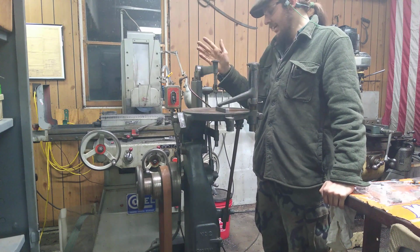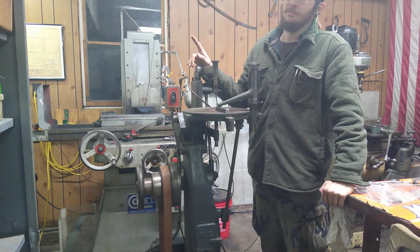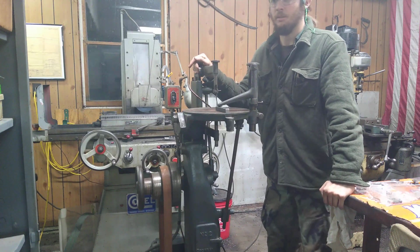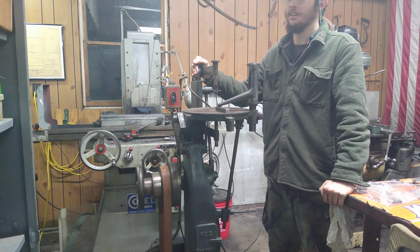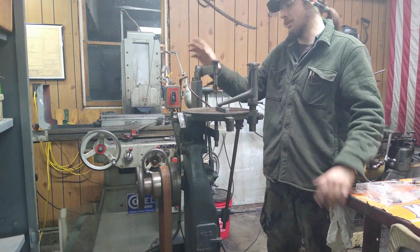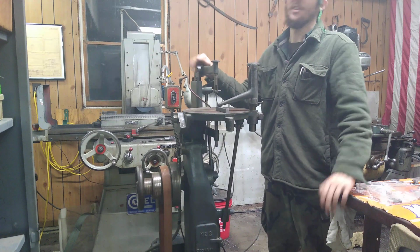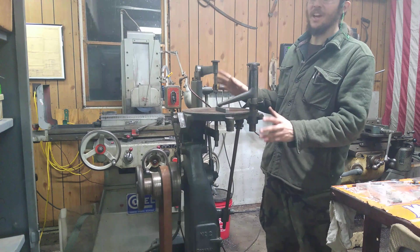So yeah, you can run a 3-phase motor on single phase if you spin it, but if there's resistance, it can't quite get up to speed, it doesn't really want to go, and it'll kind of bog down and make weird noises and be unhappy, which is what it did. So that's why I'm refilming it. Sorry for that long intro, but on to the actual machine.